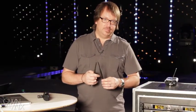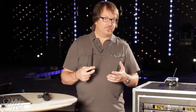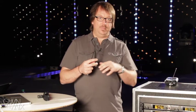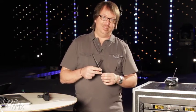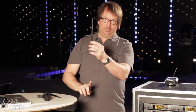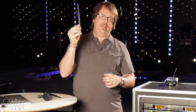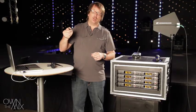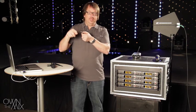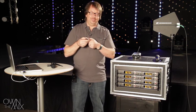Regarding omnidirectional antennas, it's important to remember that when we say omnidirectional we're talking about the horizontal plane only — not a full 3D sphere like with microphones, but more like a donut shape. If this antenna is oriented vertically, the donut extends horizontally around it, and the stage in front of it is in that coverage zone — that's great. However, if the antenna is tilted so the axis points toward the stage, that direction actually becomes the null, or the point of least sensitivity. So that orientation would be a mistake.